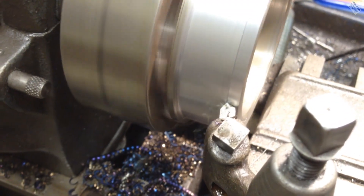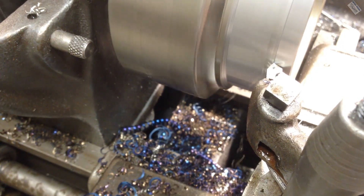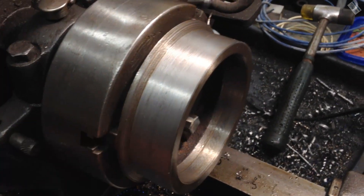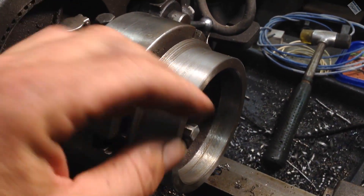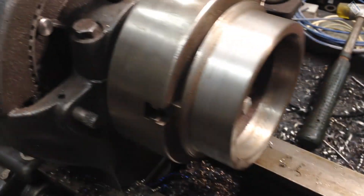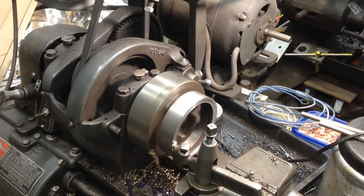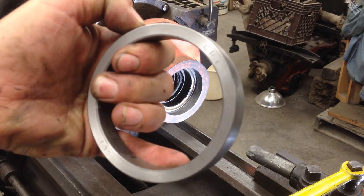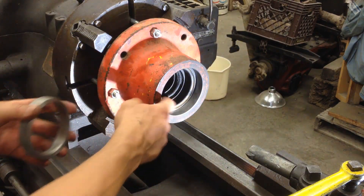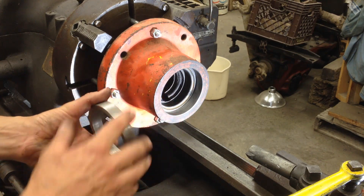It must be a little smaller in diameter now because it's not turning the chips purple anymore. I've got this little ring here — the way I figured it out, I'll do all the machining operations this way, then take it out, flip it over, and face off the other side to length. I stamped an orientation mark on the ring so that if somebody pulls this spacer out later, they'll know which side faces out — I've got a chamfer and other features on it, so it's not equal on both sides.